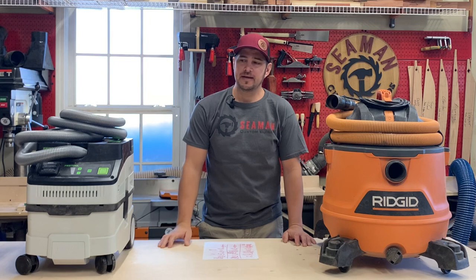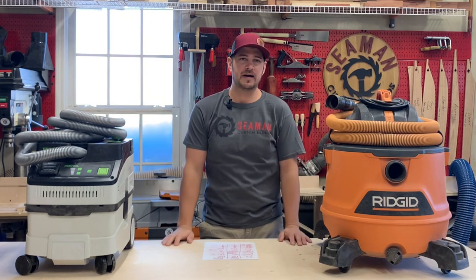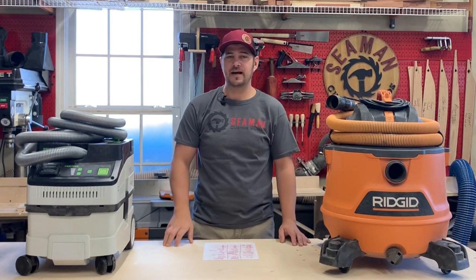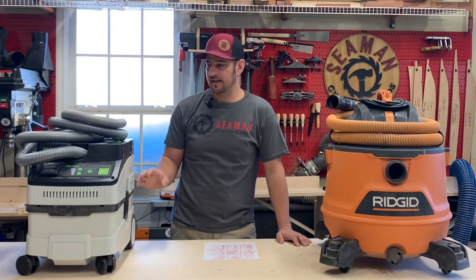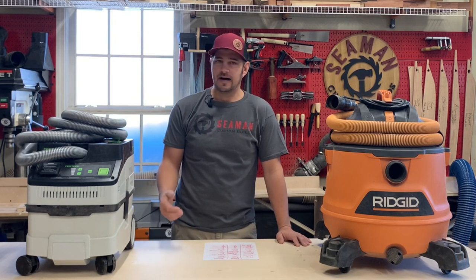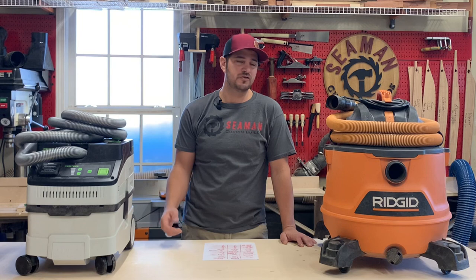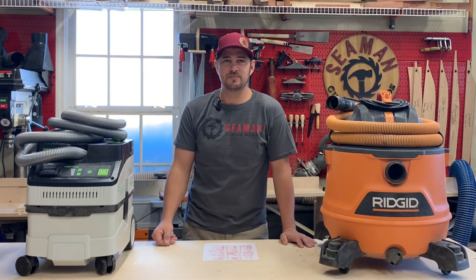As a wrap-up: is $350 versus roughly $100 — give or take, if you buy the DustRite hose — worth it? For me and my small shop, I decided it was finally worth the money at $350. At $600, not a chance. At $350 it's just double: slightly smaller footprint, slightly quieter, filters better, and auto-start I liked. Hopefully this gives you some idea of the comparison from somebody that's used both in a small hobby shop.